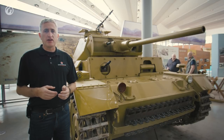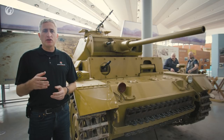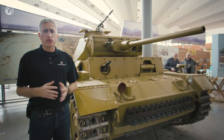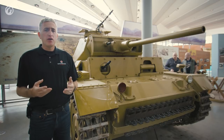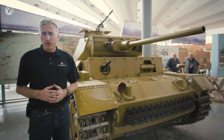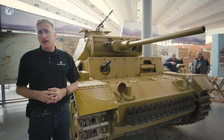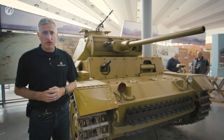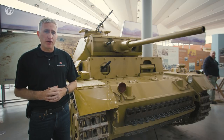Fortunately, the 5cm upgrade had been foreseen when the Panzer III was designed, and room in the turret allowed for it. Thus it was from the late G models through to the J. There was, though, a catch. Rheinmetall had an L60 5cm gun, and Hitler had personally ordered its installation to replace the 37mm. However, all the tank experts concluded that the large gun simply could not be fitted into the Panzer III's turret for a variety of reasons, and hence the shorter L42 was mounted.